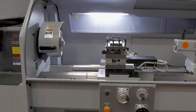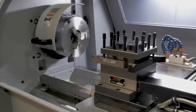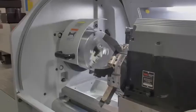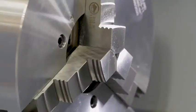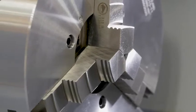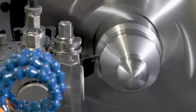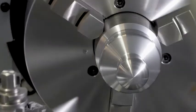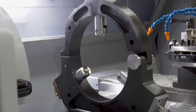If you want more production, you can have the machine fitted with a four position automatic tool post or an eight station automatic turret. The machine is fitted with a three jaw 315 millimeter diameter steel chuck, with options for a drilling attachment, four jaw chuck, face plates and a full range of fixed or traveling steadies.